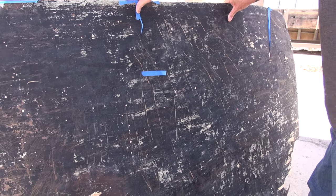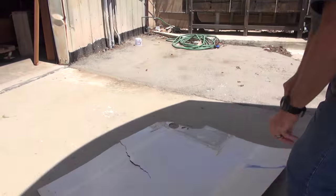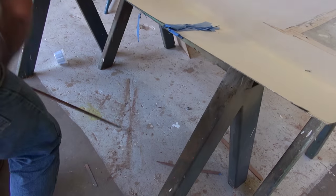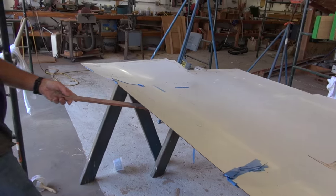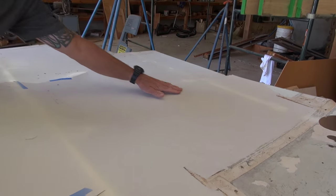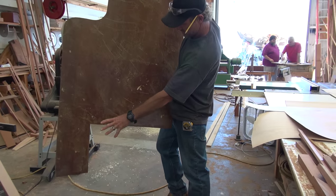So here is the old bulkhead — let's get in the shade here, it's actually better. And this is the back side of it — 5200. Yummy. But you got it all off in one piece pretty much. I used the heat gun. Did you want it off in one piece for the template? For the template, yeah. Let's turn it upside down. I put this tape on there when I was working, because when it was on the wall I had the heat gun going. I had a big long metal straight edge that I was ramming and heat gunning to get this off — heat gunning from the top, then ramming. It just took forever — that's what all these little marks are right here, from the metal straight pushing. Of course it broke in a couple spots, but good enough to get the template. That's why I took the framing and the settee chair and all that out of the way to get that one off.